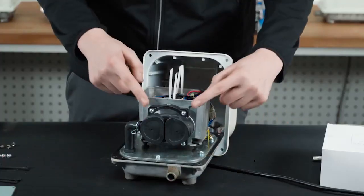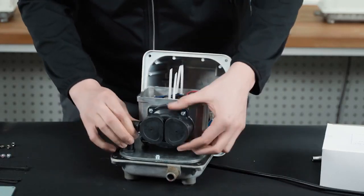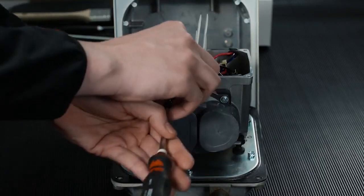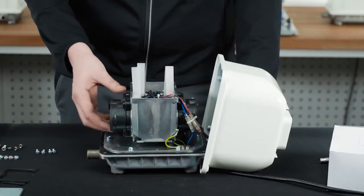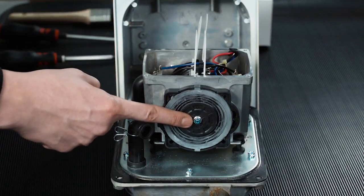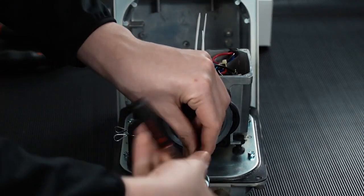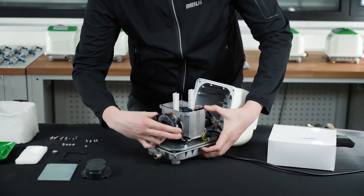Starting one side, remove the four screws and washers retaining the valve box. Slacken the clip on the pipe. Now, loosen the screws from the valve box and place everything with the parts already removed. Pull off the valve box, exposing the diaphragm. Take a spanner of the correct size and undo the retaining nut from the center of the diaphragm. Slide the diaphragm off the magnet's threaded bolt.